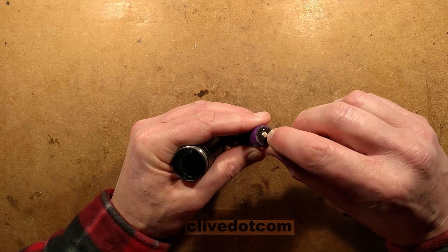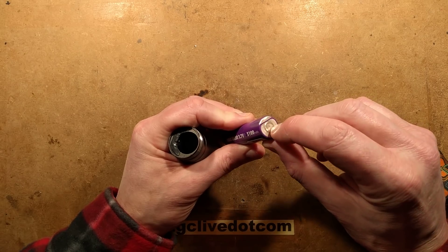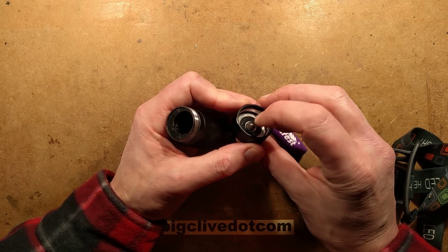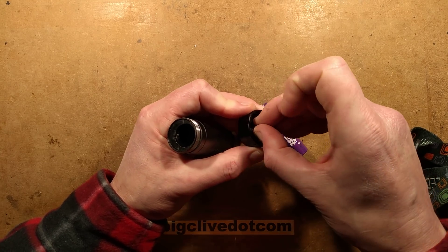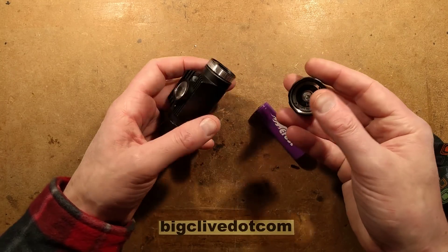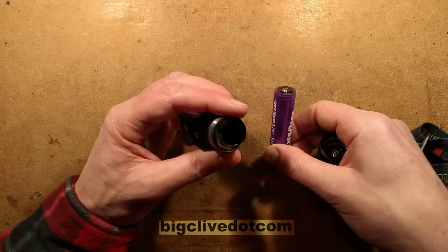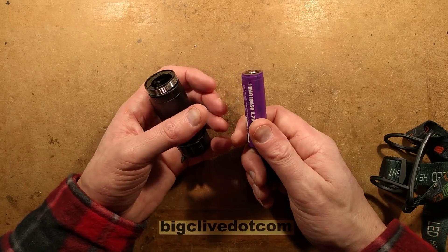The battery is all melted around the positive terminal. The other end's heat shrink has actually shrunk up and gone across the little ribbon, suggesting there has been a fair amount of heat. The springs are a bit firm and not very springy anymore - they've been overheated. I think a short circuit has occurred between the positive and negative end. I'm wondering if that was because I might have put the battery in one way round, tried it, it didn't work, then put it in the other way. The battery would have been hot.